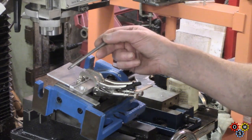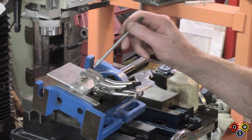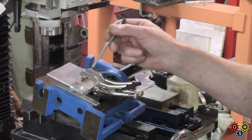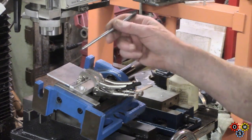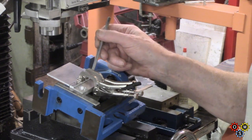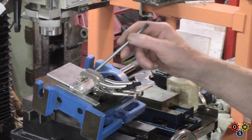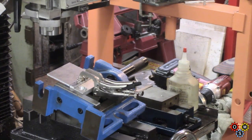This is a piece of eighth-inch plate that I'm going to attach to the magnet block. I've worked out an approximate angle that I need. I was going to take it further forward and weld it along an edge, but I want some flexibility with the choice of angle. So over at the drill press I'll put a couple of holes in and drill and tap them 8-32, fix that, then put a bend on and see how it's going to work out.